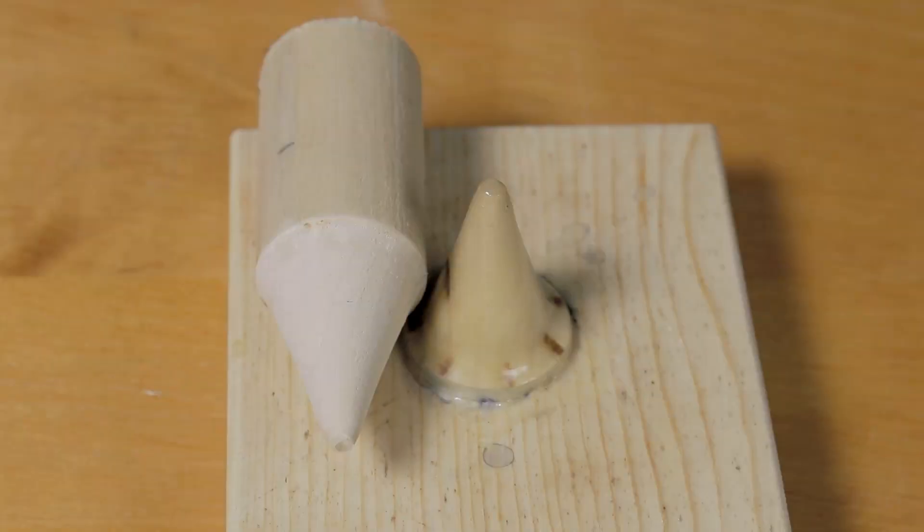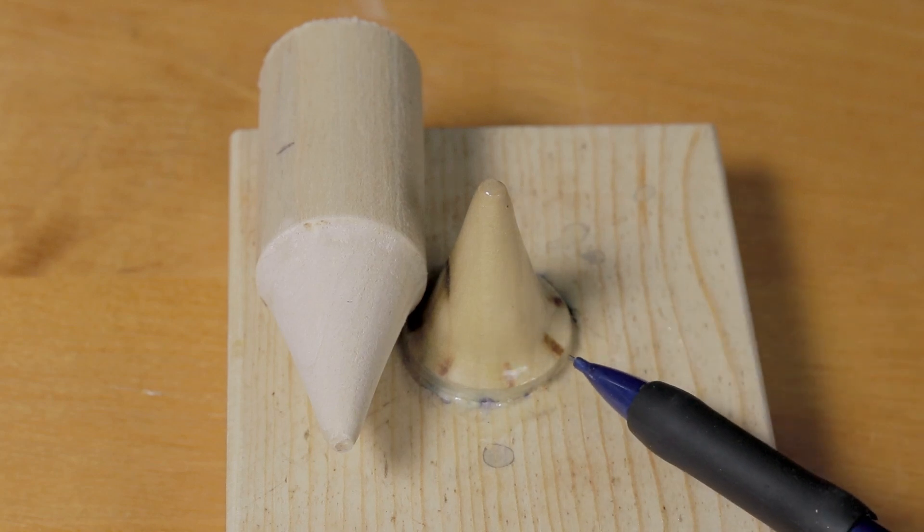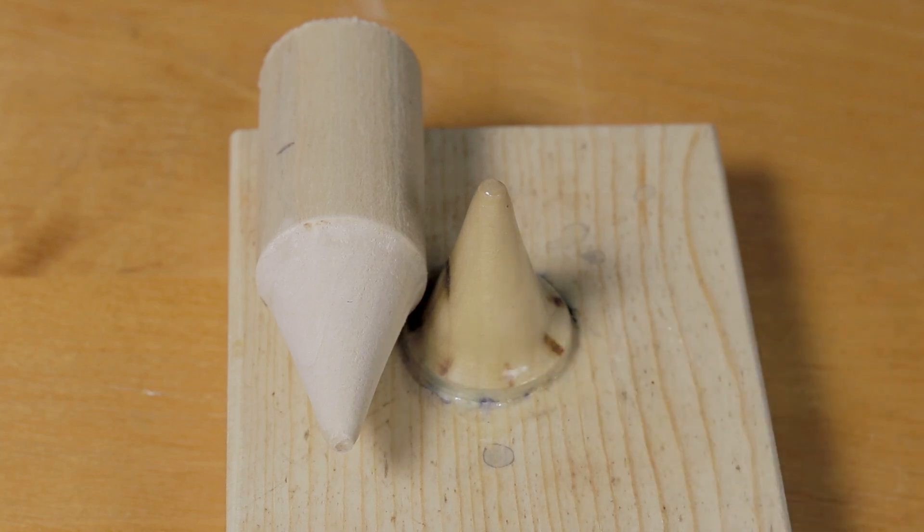After the pins are cut, they should have a little bit of a shoulder on them, like this. The pin on the left doesn't have quite enough shoulder. Now, we can still use that pin — it'll just change the dimensions of the nozzle itself and make it a little bit longer. But that's okay. Try to get the pin to look like this.